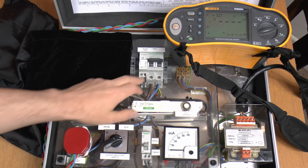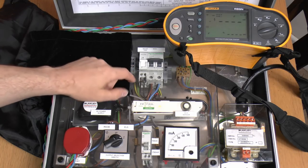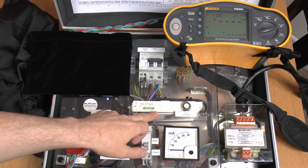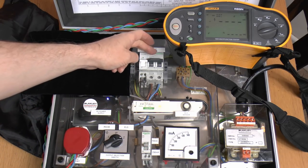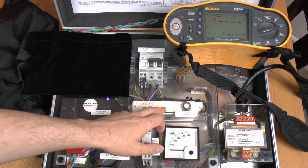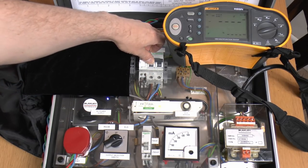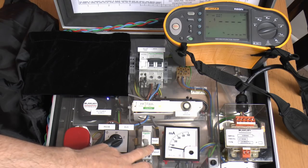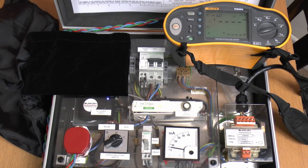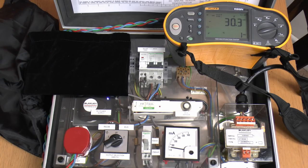Now what I've got in this setup here is a two-pole circuit breaker, and on the side of it we've got a shunt trip. This is quite a straightforward device — it just receives a signal from this here, which is an earth leakage sensor. This is just basically a mechanical thing which will trip off the circuit breaker once this thing detects that the current has been exceeded. And just as with an RCD we can use the test button, and again it just trips off exactly as you would expect. So we've got 50mA being injected through here of DC. Tripping time is 30ms — so again that's plenty fine, that's well within the actual requirements. And that's in complete contrast to what we saw previously with the normal RCD, which of course didn't actually trip at all.